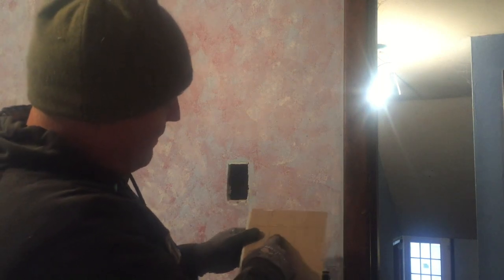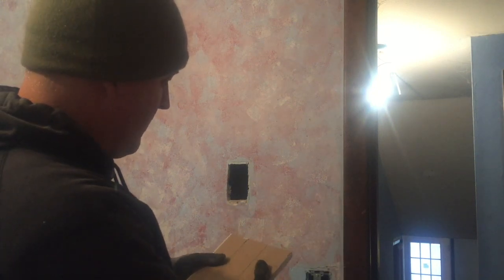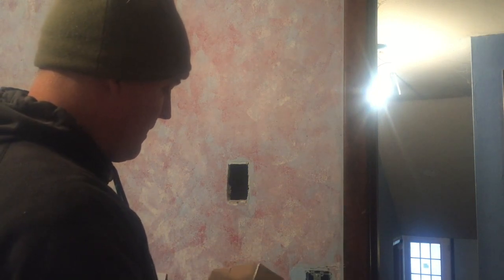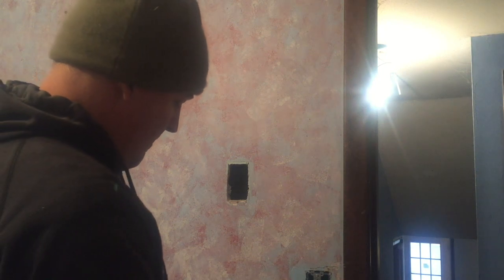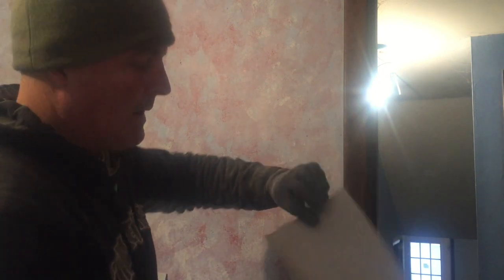So this is what we got right now. We just made a little tic-tac-toe. This is the piece that we're saving. Everything else here is gonna go. So what you do is take this, you scored that, just break it like that. Take it and pull the drywall off, but leave the paper on.